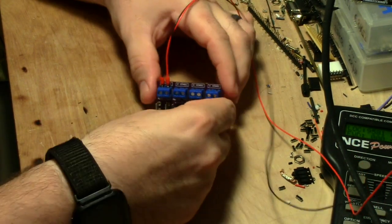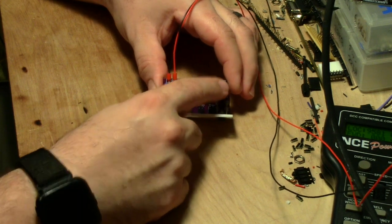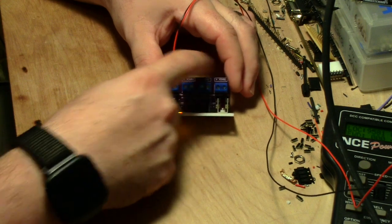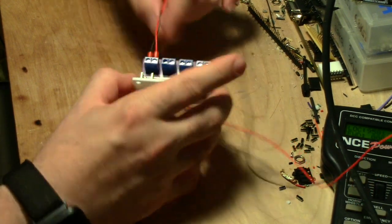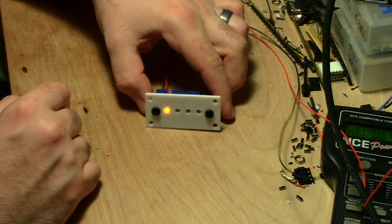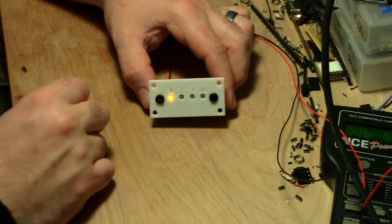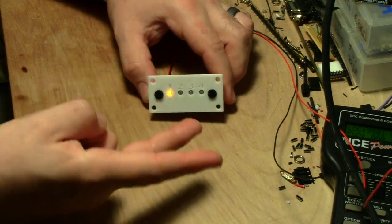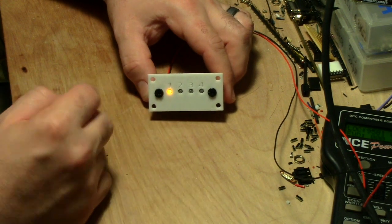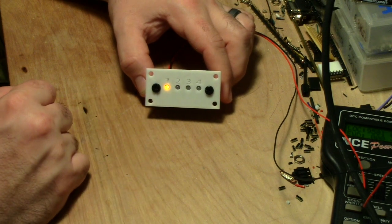So what I have here is a basic board, but it has 4 inputs, terminal blocks for each track. They're labeled. And then we have a bicolor red-green LED that's on the board right there. And as you can see, it glows orange, and that's from the polarity of the DCC flipping back and forth. It's green and red lighting at almost the exact same time, at least to the human eye, that's the way it looks. And that's why you have that orange.